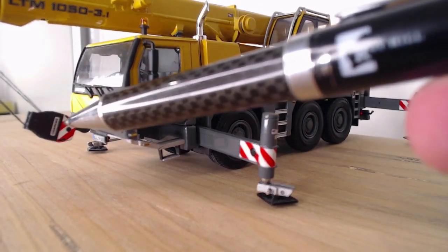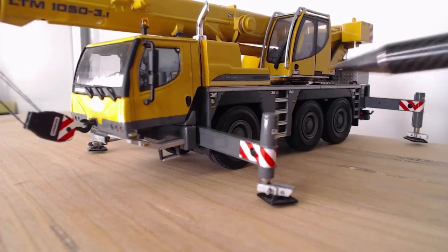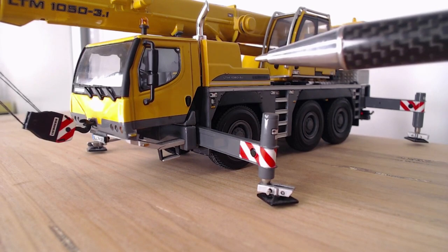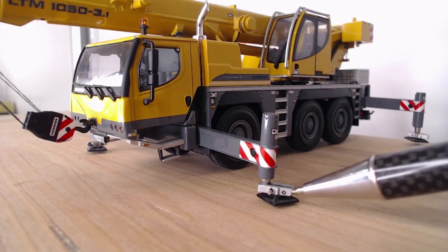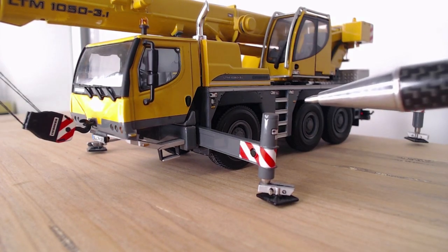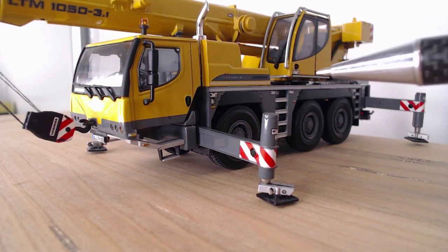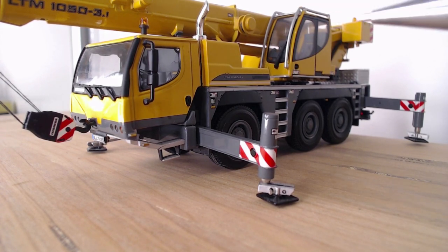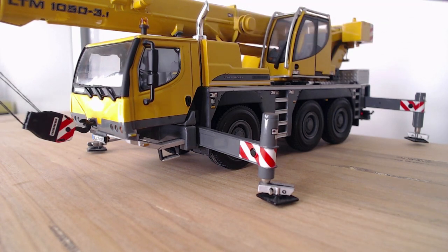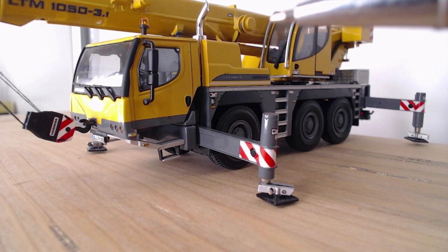Get out of the cab. Take a photo of how the hook's hooked up. Take all the outrigger pins out. Once the outriggers are out, put the outrigger pins back in. Put these sliders into the middle. Pull out all the timbers. Grab the tagline out. That's 16 things you can do without being asked. 16 things you can do with him not saying a word to you. And I promise you, if you get out and do those things quick, smart, and pronto, you'll be on all the next jobs. I tell you what.